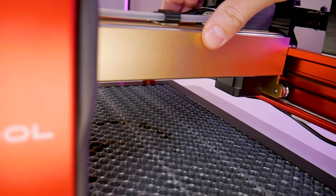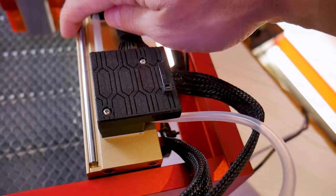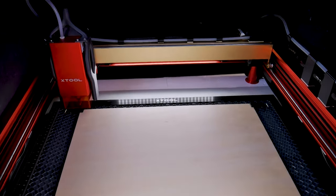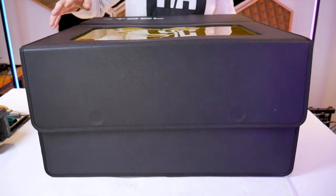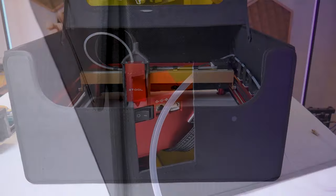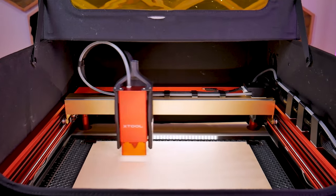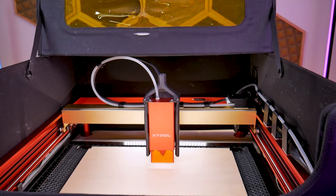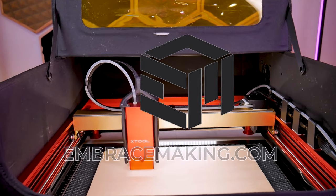The wire harness is now no longer on the bottom of the frame and it's not bending inwards towards the work area, potentially coming in contact with your workpiece or dragging along the rough surface of the honeycomb bed. At the end of the y-axis travel there's now sufficient room for the harness so that it does not get pinched between the gantry and the rear frame member, and the rear limit switch can properly work during the homing process. One of the nice things about this kit is that it's fully compatible with the X-Tool enclosure, and the new wire and hose management system puts the entry point for the air assist tube right at the existing hole in the side of the enclosure. Check out my other modifications like the D1 Pro LED lighting kit, as well as more accessories and upgrades for the X-Tool D1 Pro on my YouTube channel and website EmbraceMaking.com. Thanks for watching.